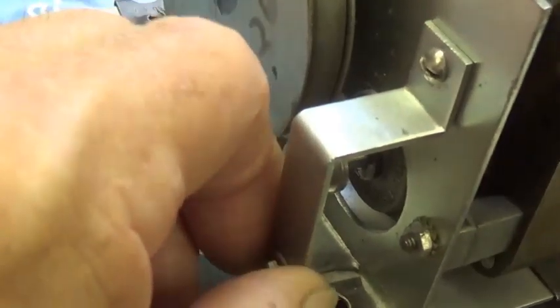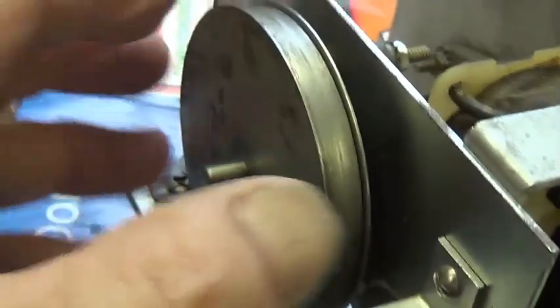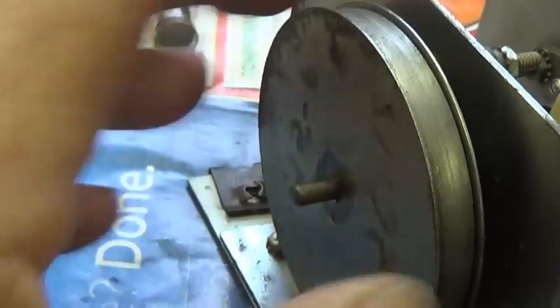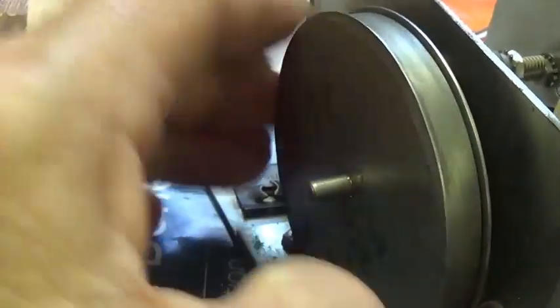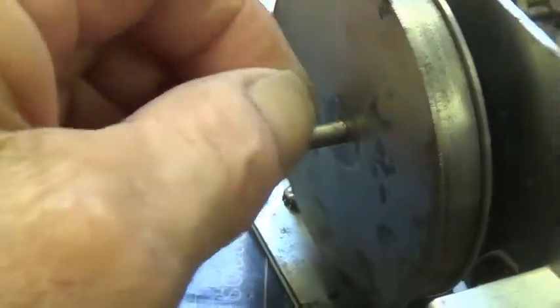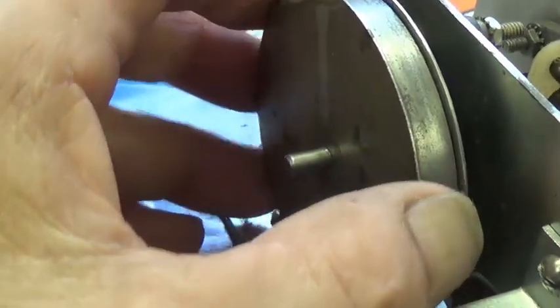Okay, I install that vibrato pressure adjusting arm that is sort of unique to this unit since it's an early one, and I also install the pulley on the drive shaft. It was a little loose, it tended to want to spin, so I put a tiny bit of super glue into the space between the axle and the pulley, and now it's on for keeps. Now, if I ever do choose to remove the pulley, all I'll have to do is put a soldering iron in here and heat up that junction so that the super glue will be dissolved and I can just remove the pulley easily.